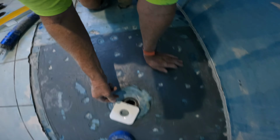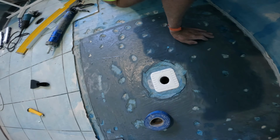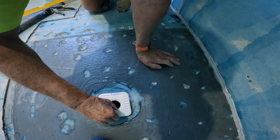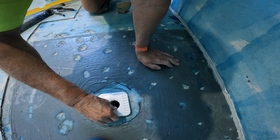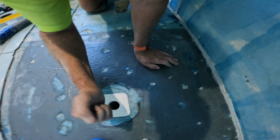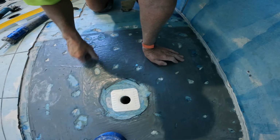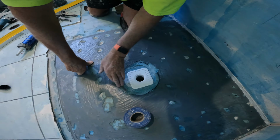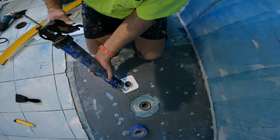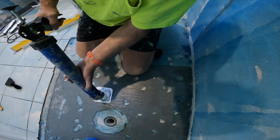And this year, it was the same as the ensuite. They had a puddle flange, but it was sticking up. Like, easy, 12 mil. Well, your water can't drain away. The best way to do it is you bang it in like that, you have your floor above your puddle flange. I'll just put it in while I'm here.